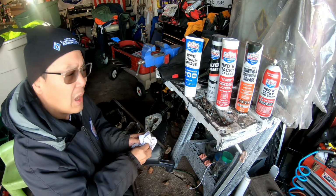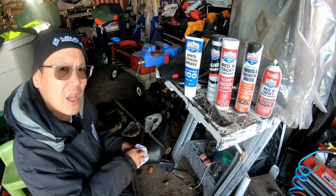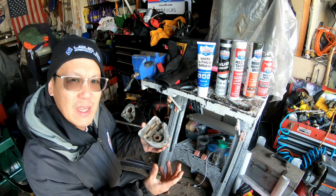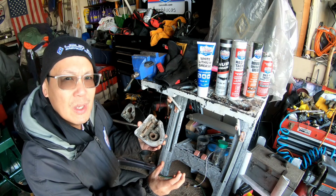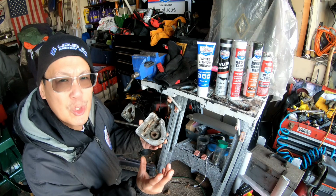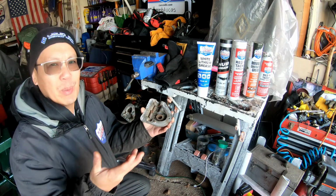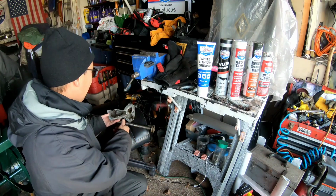But I wanted to talk about the lubrication for this gearbox. What kind of grease should I use? In the videos that I've seen, when they pack this thing full of grease, they use, I think, 00 grease. 00 grease, I believe, is really thin grease that's not like number 2, but almost close to number 1. I've seen them squeeze it in, and it almost looks like black, thick oil, because it's very syrupy.